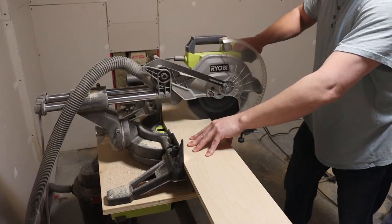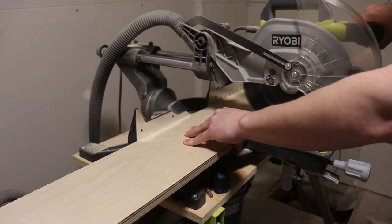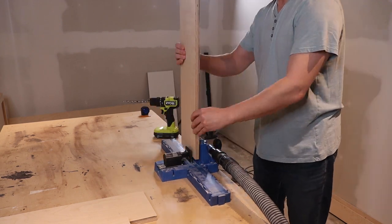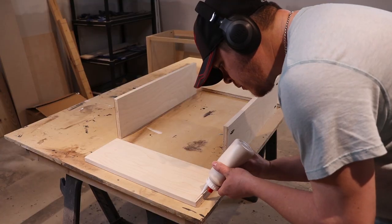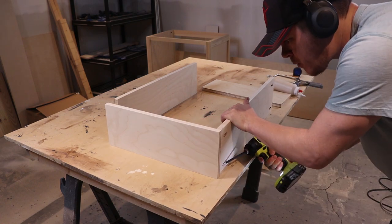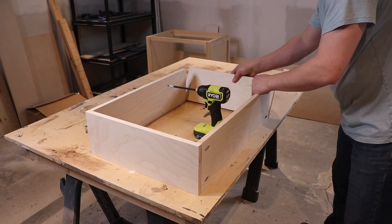With the body done, we can move on to the drawer, and I've shown how to do this lots before, and I have a completely dedicated video on my channel, so if you want more info, go check that out. But I should have checked it out, because this is where my mistakes started to happen. I forgot to leave enough room for my drawer slide, so my drawer ended up being an inch too big. Luckily, I found it before I put the drawer together, so all I had to do was cut down my front and back sides to adjust the width, and it was all good.